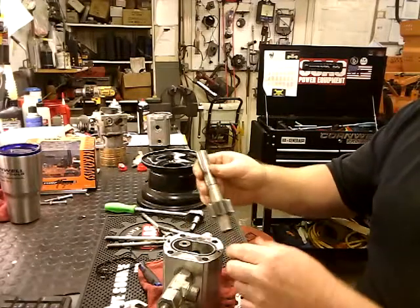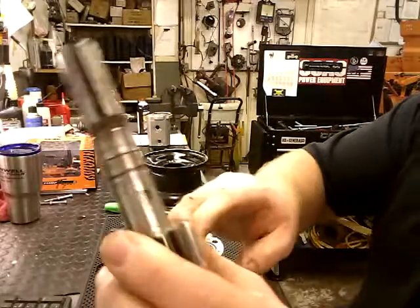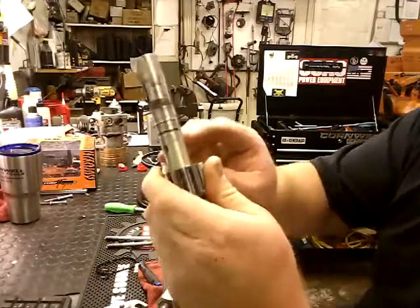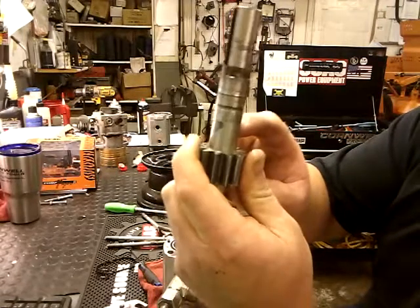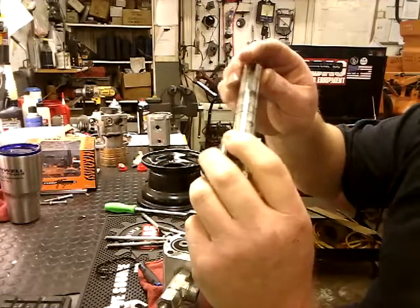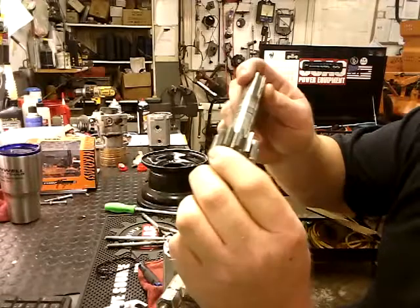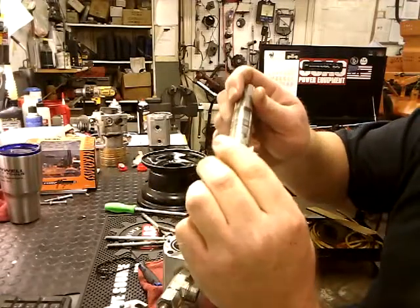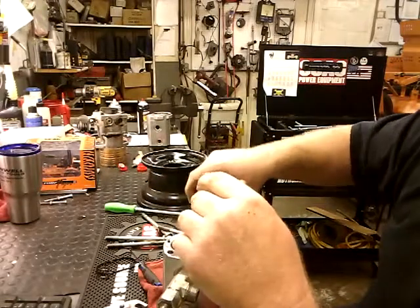Now at this time, check your shaft for wear. Now, the shaft is shot and you cannot get just a shaft to replace this. So putting the new seals on will work for a short period of time. This pump is $1,500. This needs a new pump because the shaft is worn out. So you can go do two things. Replace the seals and drive on from there.